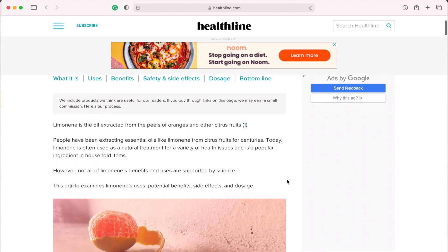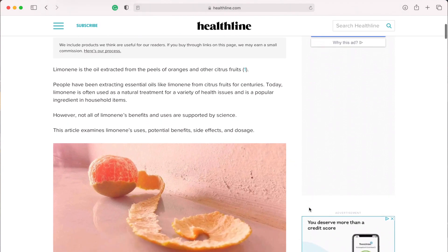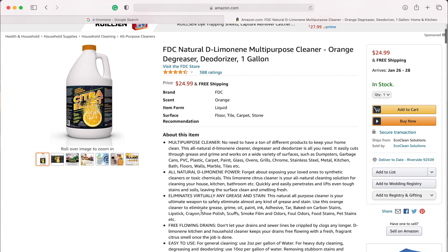HIPS is not a water-soluble support material. If you dropped it in water expecting it to dissolve, you would be very disappointed. What it does do is dissolve in a chemical called limonene. Limonene is a chemical found in citrus plants and you can often find it in cleaning agents. There are quite a few different types of limonene and they're not all created equal — they will not all break down HIPS — but the most common one that seems to be used is D-limonene. I definitely would not want to use HIPS all the time as a soluble support material given the time it takes to break down, and constantly having to get limonene is just another reason why I wouldn't opt to do it willingly unless necessary.